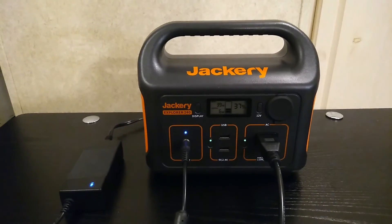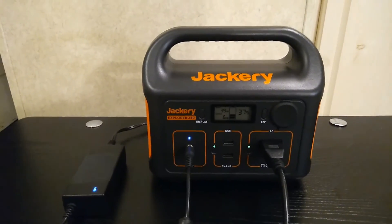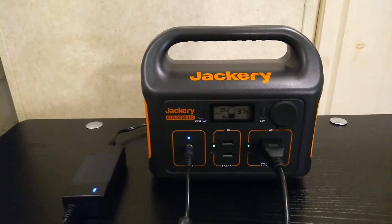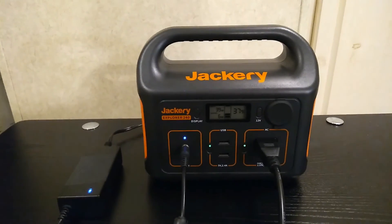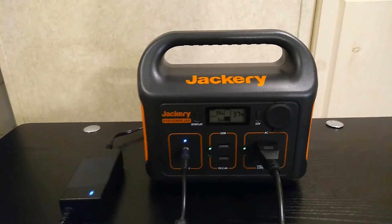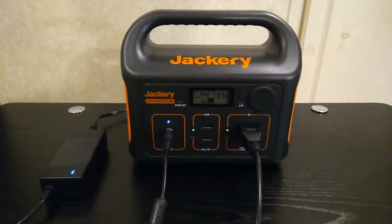It's pretty simple: the more you're doing, the more heat you're creating. But if you're doing pass-through charging with relatively low power going in and relatively low power going out, and you're not maxing both at the same time, you're not going to exceed what they intended when they designed the unit. You won't be damaging the battery or reducing life cycles unnecessarily. So do pass-through charging, just try to keep both input and output at lower amounts — don't max them both out simultaneously.